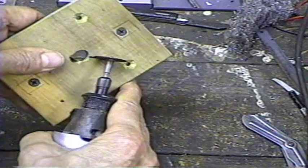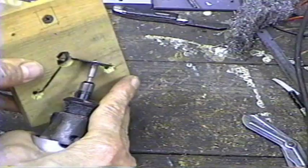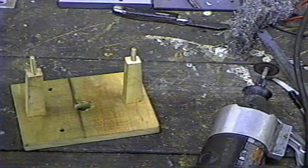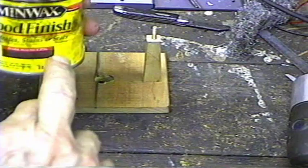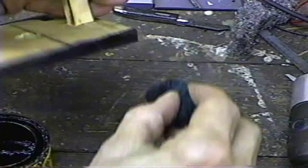Next, we're going to stain it, make it pretty. Okay, the stain we're going to use is a mixture — it's one half brown leather stain and one half Minwax dark walnut. This makes a very dark stain that is very close to what they had back in the teens and early part of the century. It's extremely dark — they made it out of wood tannin. That's not really available anymore, but this works very well. Makes a very dark color on wood. Looks just gorgeous and very period. Just take a rag, just a little piece of felt.